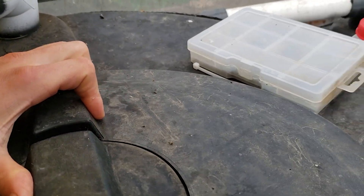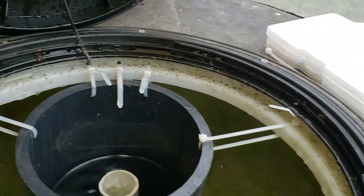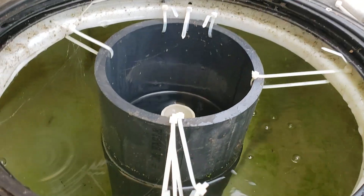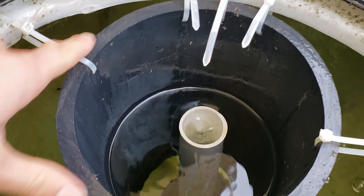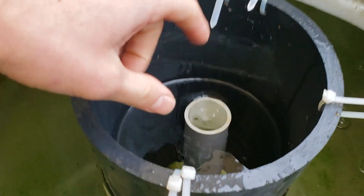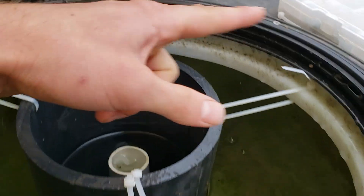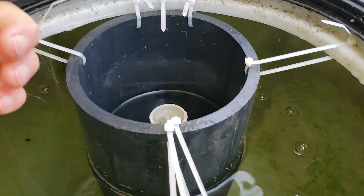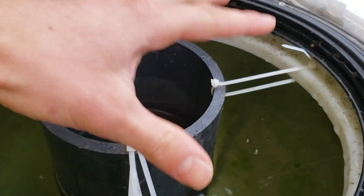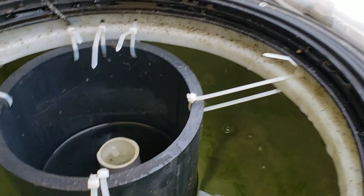If I can take off this lid - I also kind of use them as tables for stuff right now. But this radial flow filter is set up. I don't even know what you call these things, but you've got this baffle over here, or the circular pipe plus the pipe where the water goes down. The water is entering from here at a swirl and then the water swirls around in here. This pipe is supposed to allow solids to settle, so the solids go down and the clean water comes back up and goes out through here.